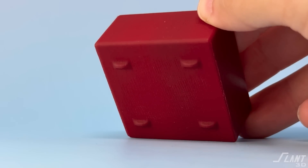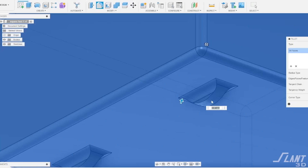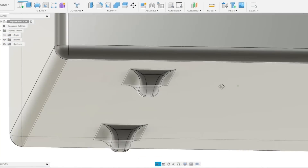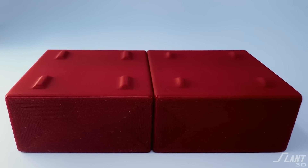This is the fundamental rule of designing feet: when you have features coming out the side of the part, make sure that you are rounding every single possible edge. People very often leave sharp corners within 3D prints — that is a mistake. Make sure that you fillet the edges. It radically improves quality, improves print time, and makes the overall part more manufacturable because you don't have points of error where there could be retraction issues or anything else. Round all the edges and blend those feet as much as possible.